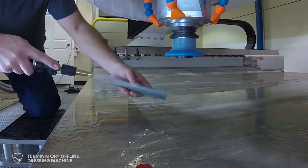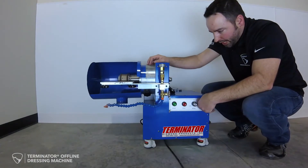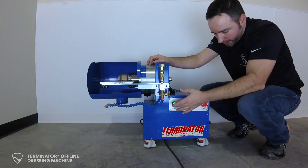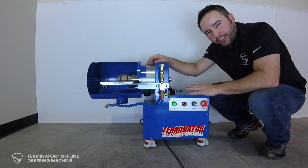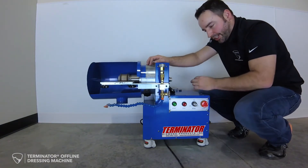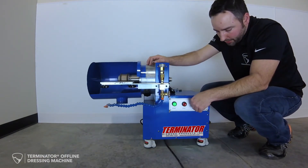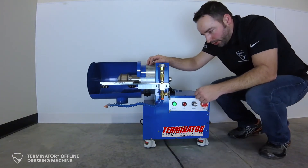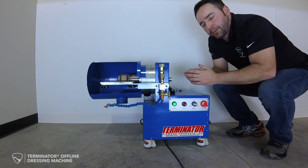With the sticks being full of water, having soaked up some water, the key advantage of having a high-torque motor is the avoidance of bogging the spindle down as we are dressing — that is not an issue with this machine. I can dress the tools as low as 500 RPMs without bogging the spindle down.